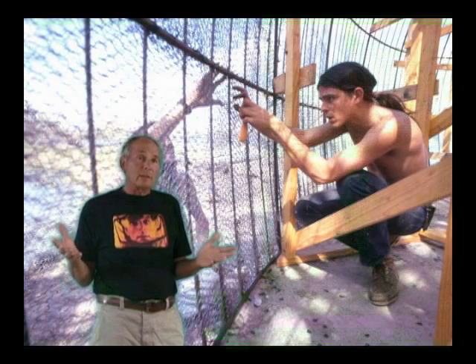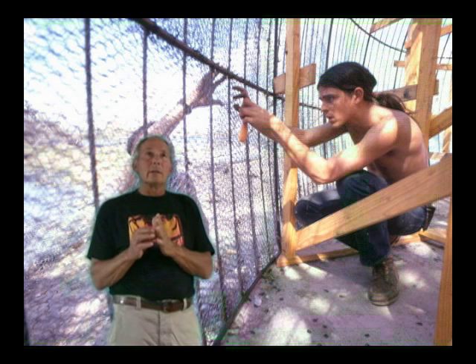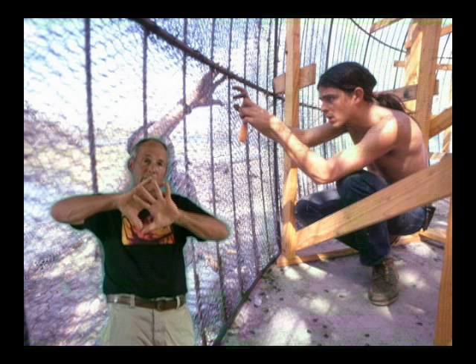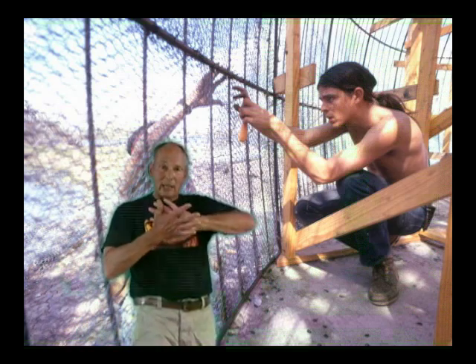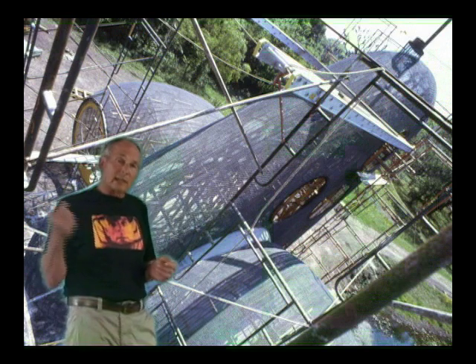The surface of the shell is like a boat. It's eight layers of chicken wire — four on each side of quarter-inch rods running every 12 inches. So you have a grid of steel rebars with four layers of chicken wire on both sides. As this thing progressed, it was just amazing to see the reality happening before our eyes.